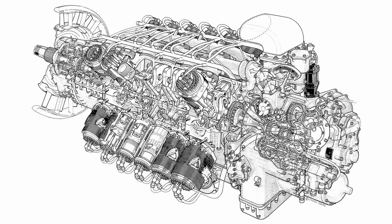The initial design included a hinged cap on one side secured to the crankshaft with two bolts on the other. However, the setup caused issues, so engineers replaced the hinge with a four-bolt configuration — two longer bolts on one side and two shorter ones on the other — to better secure the cap to the crankpin. Serrations on the mating surfaces ensured a snug fit. This design was also used in the Rolls-Royce X engine, developed slightly earlier.